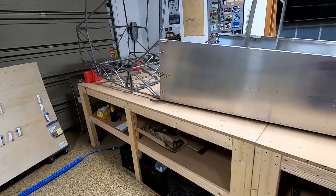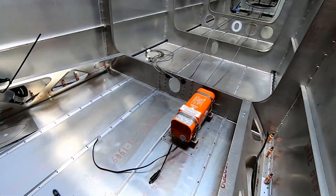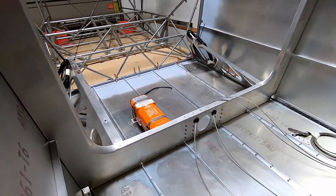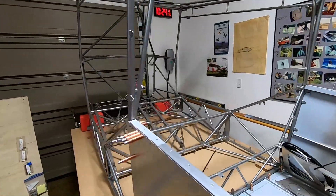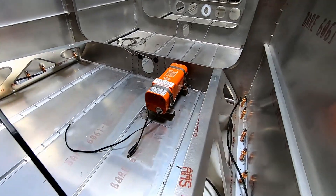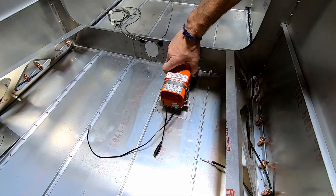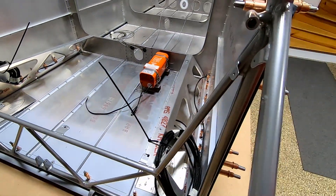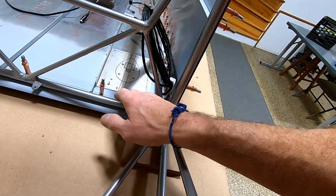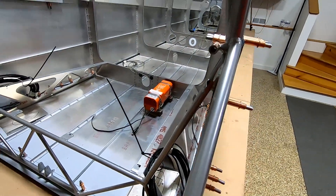She's back where she belongs and the ELT is mounted — nice and solid. I really like the way that came out. You get three rivets in the back and probably 15 to 20 rivets holding it in, plus 8-32 threaded T-nuts for serviceability. Tomorrow we'll work on these plates — George already did all the hard work. Hopefully these go quicker because it took me two days to get that ELT mount finished.